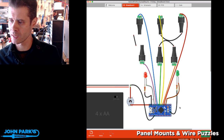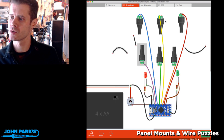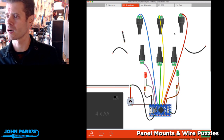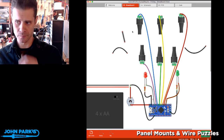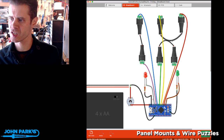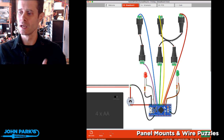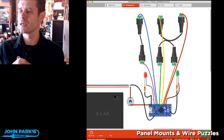And what I'm doing is a puzzle where, depending on how you connect using those, and I don't have a banana plug item in Fritzing, so I'm just using some of our audio jacks, but only one terminal on these is wired because the banana jacks are only a single conductor. So the idea here is this is a puzzle where each of the jacks has a different color on it, mostly color-coded to the wire you see I have on here. And the player would have to connect up the proper pairs of these plugs in order to pass the puzzle. I'm doing this in an escape room sort of style, except it's just a proof of concept. So all I have is a red LED and a green LED. It's going to be red when the project starts or is powered up, and I'll have a little on-off switch for that. And then when the proper connections are made, it's going to go green.